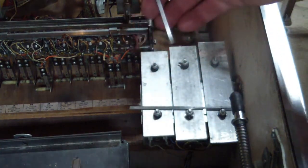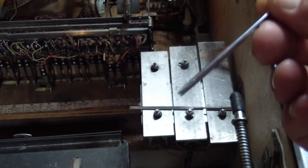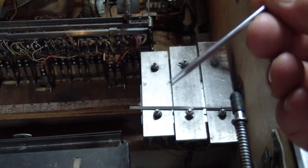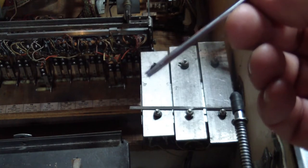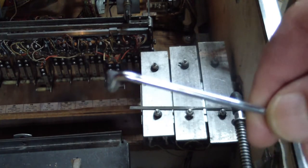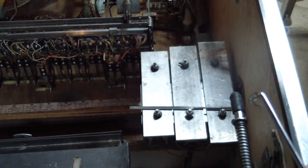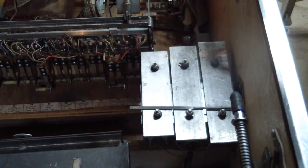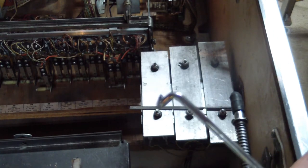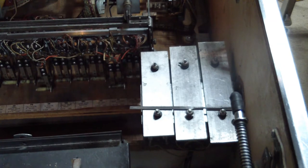The second tool was a contact adjustment tool. It has a slot on both ends, and you slide that slot into a leaf on a contact and bend it by rotating it — you can bend the switch this way or that way in order to make it close or open properly. I did clean everything with IPA afterwards to get rid of whatever the file took off, but it probably wasn't even necessary. I had no broken switches or leaves or anything — everything was good. It was just neglected or not adjusted recently. And after doing all of that, the machine became functional.